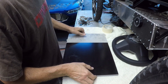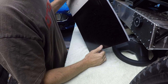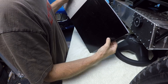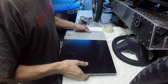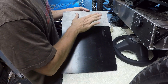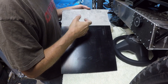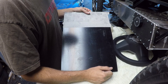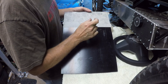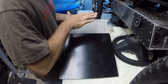Now, buying this composite in an inch and a half thick section — I haven't been able to find it that thick in this size. I didn't do a huge amount of research, but the thicker you go, the more expensive this stuff gets. I actually had this half-inch thick material from other projects. You can cut this with a handheld saber saw with a masonry bit, and I'll show you that when I start cutting it. Cutting a half-inch thick piece is doable; cutting an inch and a half thick piece would take a very long time. So I'd rather cut multiple half-inch pieces and join them together.